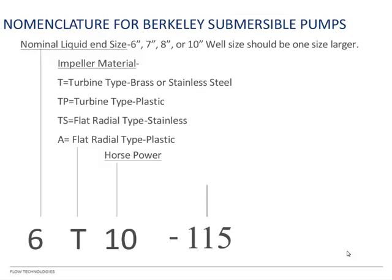All our pump curves are based on the service factor horsepower of the motor. When we say it's a 10-horsepower pump, at its max it will use 1.15 times more horsepower, so at the very end of the curve you're at just over 11 horsepower — we design the curve right to that point. The last number after the dash indicates the rated flow of the pump, which is where the pump operates at its best efficiency.